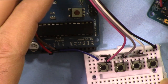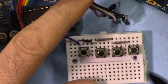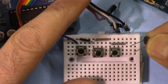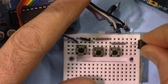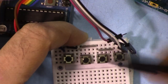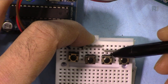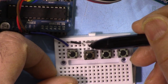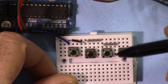Let me explain the wiring first. For the switches, I have four push buttons. These push buttons have two pins — on a four-pin version, two pins on one side connect to the other side, so they're the same. I'm inserting them with one pin in between, so between pin one and pin three. Each push button spans two rows on the breadboard — one pin in this line and the other pin in the adjacent line.